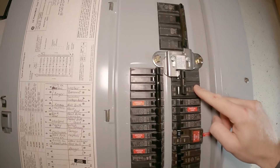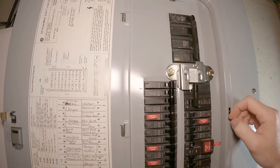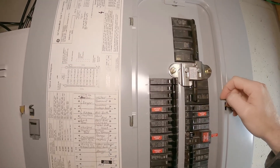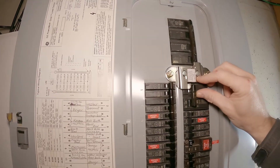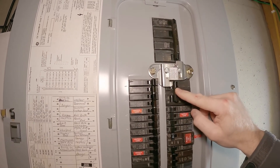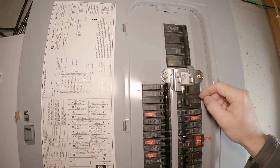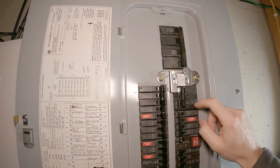In the top two slots of my electrical panel, I have a 30 amp 240 volt breaker. What we have here is called a generator interlock. What it does is keep me from turning on the generator backfeed circuit while the main breaker is on, so I'm not feeding electricity back into the utilities. I have to turn the main breaker off first, and then push the interlock up to turn the generator backfeed on. That prevents me from turning the mains on while the generator backfeed circuit is active. So now with my generator running, I'm going to turn my mains off, plug my cable in outside, and then turn the generator backfeed on.